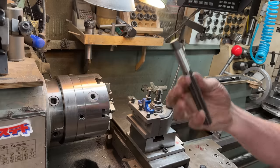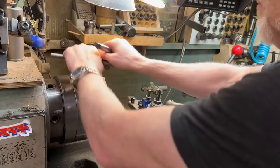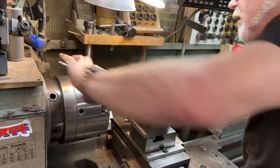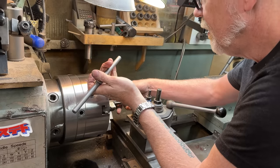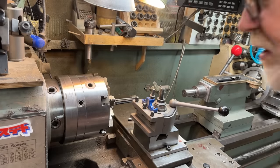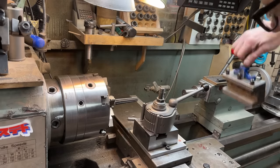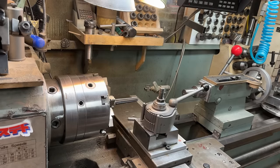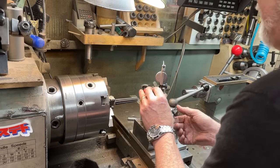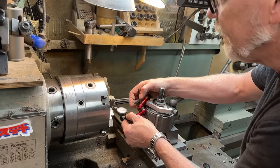I'm going to drill that out by chucking this. I recently adjusted the concentricity on this to be quite high. I'm going to make sure we get some extreme concentricity on this. The reason it's worth it is because every bit that I'm off on the concentricity is going to throw off what I'm actually trying to make.